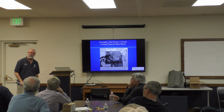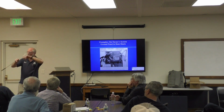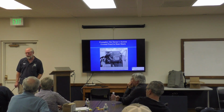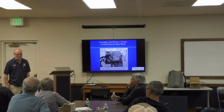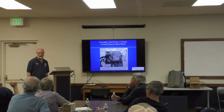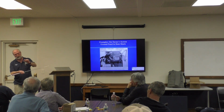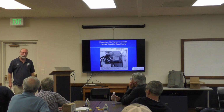The schools teach that you should be getting out of your car if there's lightning anyplace close. Yeah, because a car has breaches. It's not perfect, it doesn't completely cover all the space around you. There's intervening paths to get in that are not shielded. That's why you don't want to take things to the limit in a car. I agree, you want to get out of the storm if you can. But the fact that it's sitting on rubber tires, and rubber's a barrier to ionization, and then the distance between ground and your metal wheels, all that stuff helps provide a little bit of protection.